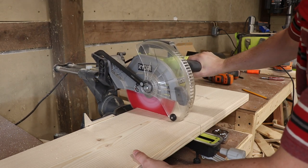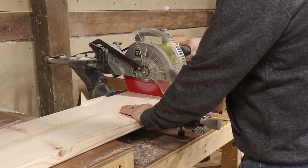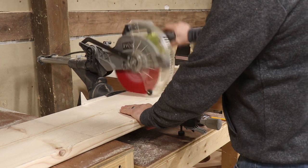I think I'm going to go ahead and use 1.5 inch pine material for this build. Now this material doesn't always come with a great surface finish, so I'm going to be using a planer to plane the thickness down to 1 1/8 inches. Once I've done that, I'll load each piece into the X-Carve and cut it out.